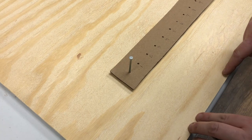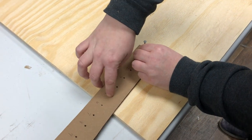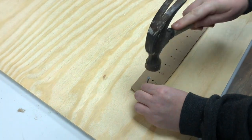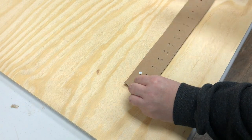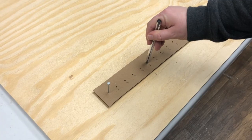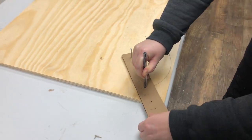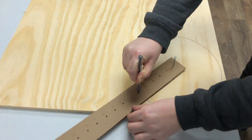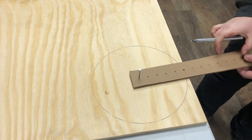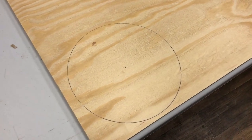I'm going to make my 10-inch circle here, making sure I leave enough space — about five inches on all sides — for where I'm going to be making my circle. I'm going to hammer the nail in just enough to hold it securely into my piece of plywood so it spins with ease. Then I'll use a sharp writing utensil and draw my line all the way around. There I have a 10-inch wide circle. You just remove your protractor and you have a perfect circle to cut.